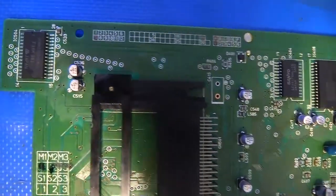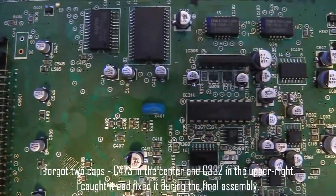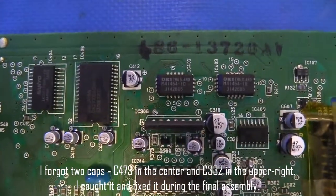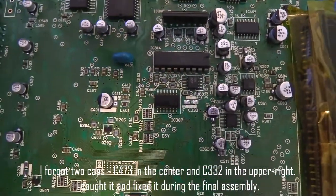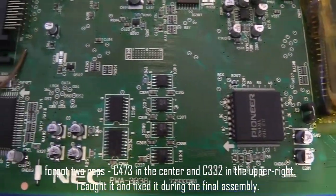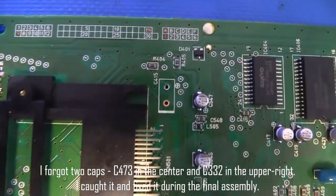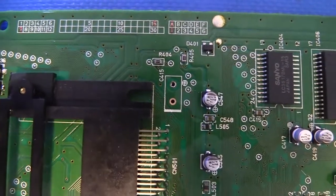You know, there were a few pads I had to scrub some corrosion off of, but for the most part, this was a really clean board. I'm really glad that there wasn't much circuit damage and no lifted pads. I mean, this went about as cleanly as one of these boards can get. Now, the only thing I haven't swapped yet is the supercapacitor that holds the save games.